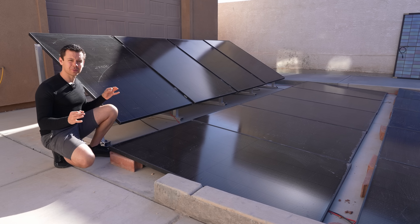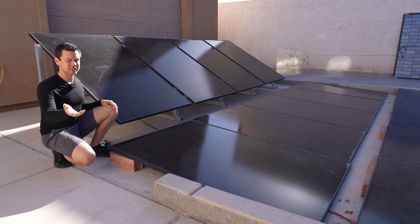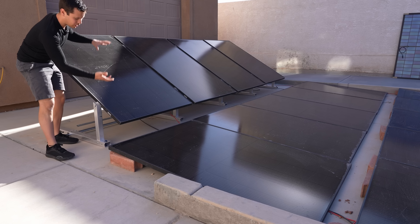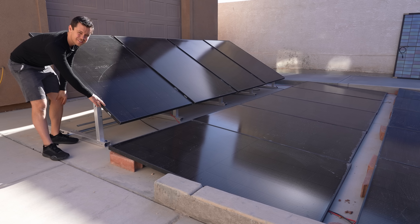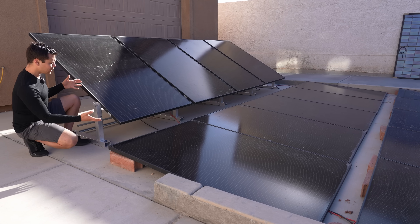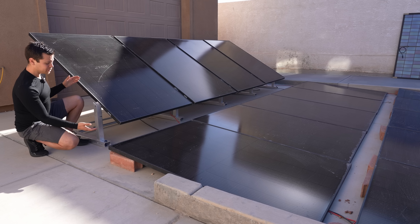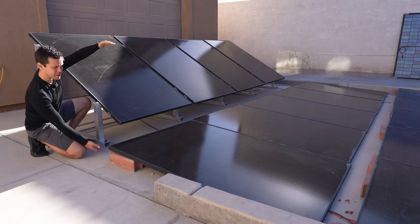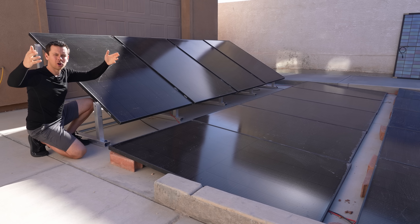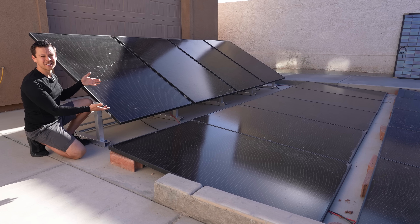I always measured a gain of five percent, but I want people to realize — and I've made videos about this in the past — that if you want increased bifacial gain you have to lift these panels up a lot. Just putting them on this mount is not going to give you much bifacial gain unless you have a bunch of snow in the back. If you want to collect radiation from the back you're going to have to lift them up a lot higher. Most studies say at least a meter in front of the panel, and ideally you want to put them up as high as possible, like on a carport.